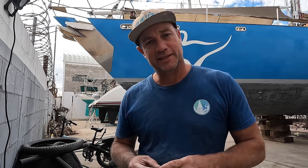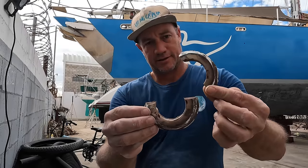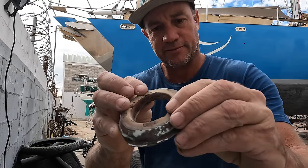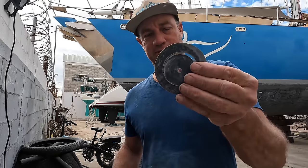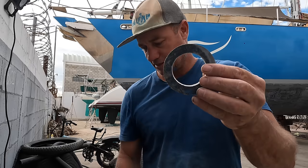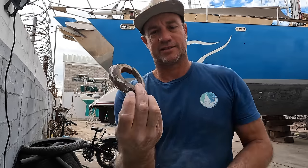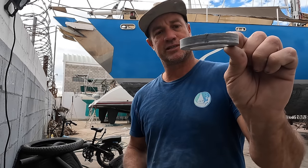While I'm still at it, I've made the covers up for the centerboard pin. I have got a broken fairing block — which is just timber — that was the old fairing block for the Raymarine transducer. You can see the angle. So what I've done is use a three-inch hole saw on the G10 board and then followed by the two-inch, which is the transducer. I'm going to shape this down to pretty much mirror that shape. Instead of having a piece of timber under the boat that's exposed and rotten and broken, we'll have a piece of solid G10 fiberglass. So that's the next task — whip this one out while we're playing around with the fiberglass.